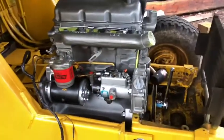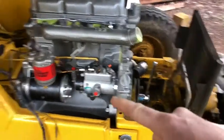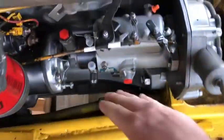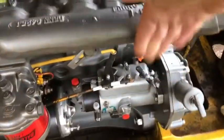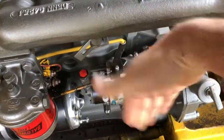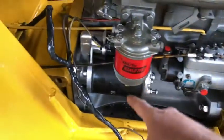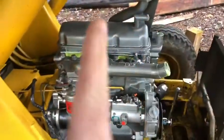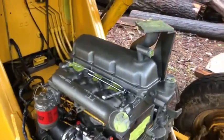I had the whole engine slung - the fuel filter and starter were not on the engine, but the injector was. The first sling sits right in this groove here so it can't go anywhere, comes straight up, and the sling sitting on the intake bridges straight across down to the block, so it doesn't even make contact with the injector pump. The other sling just came up from here, so I basketed the engine with two slings and then had two Keto jacks with gear reduction.